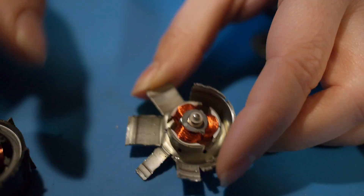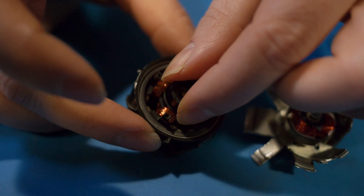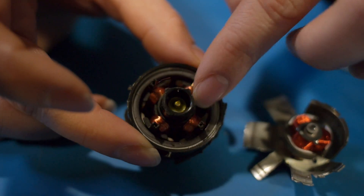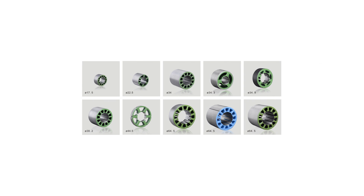The portion that moves or rotates is called the rotor — the inner armature on the disc motor and the permanent magnet on the fan; these are the rotors. On the fan, the armature is connected to the shaft with a bearing that allows it to spin freely. The part that remains stationary is called the stator. The metal tooth lamination is often referred to as a stator, but really it can be either the stator or the rotor.